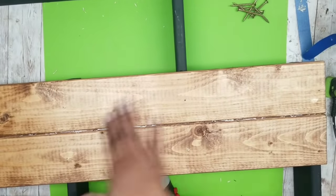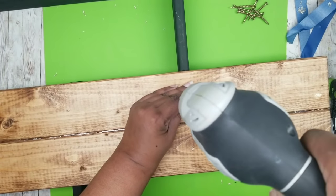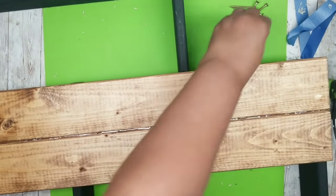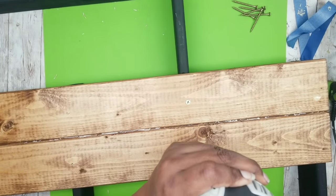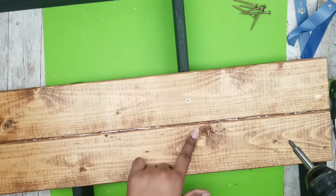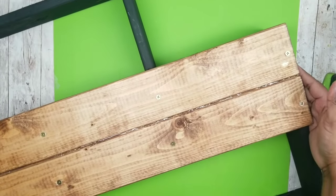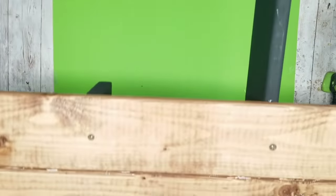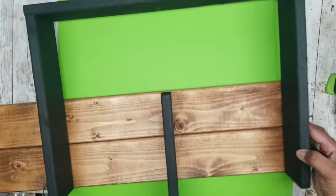Remove your tape and start applying your wood screws in all of the pilot holes. Slowly apply them, making sure they're absolutely straight going down into the wood shelf. You always want to drill pilot holes to make sure your wood doesn't split and that the screws stay securely in place. You'll have two screws on one outer edge, four screws in the center for the shelf brackets, and two at the very end. Once you flip it over, your shelf is now nice and solid and screwed together — one solid piece.